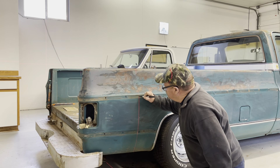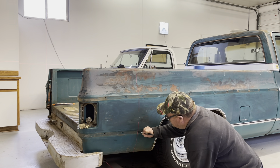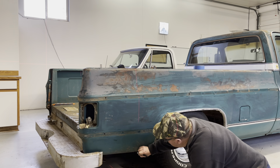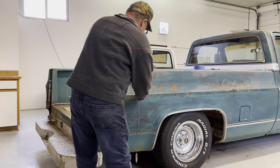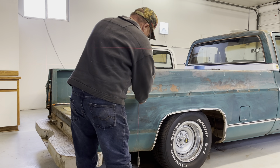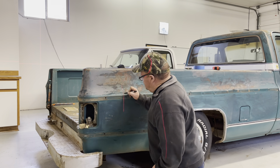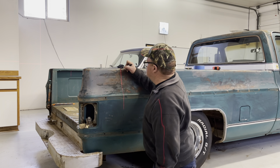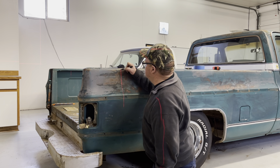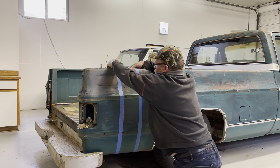As you can see in the photo, there's a red line cast on the body that follows all the contours. That's a Bosch auto-leveling laser device that shoots a beam both horizontally and vertically. We use that to mark the sides of the truck. I got a plumb bob out just to confirm that it was indeed straight up and down, and then I went ahead and marked it with a felt marker so I could position my tape.